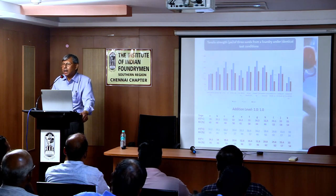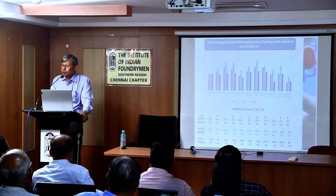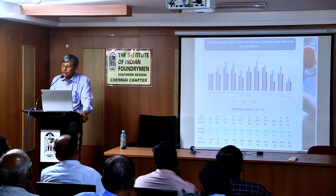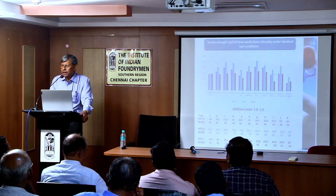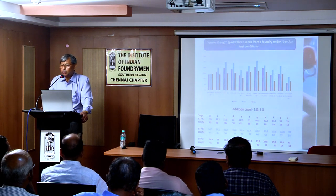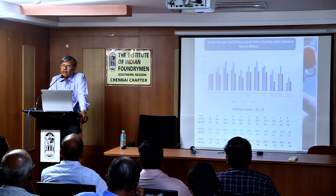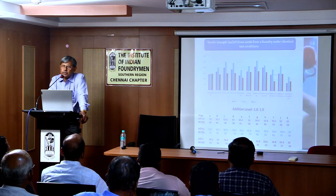Basically, the thumb rule we have decided is that for a good sand, between 60 to 70 humidity, you can use resin at 0.8. Between 70 to 80, it is 0.9. More than 80, it has to be 1% to get equivalent strength. So this is a thumb rule. You cannot expect that throughout the year and at all humidity you will get the same strength. Not possible with this system.